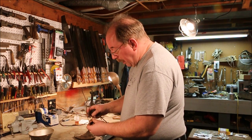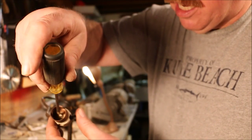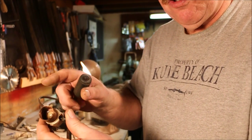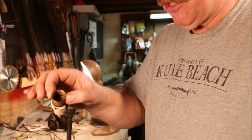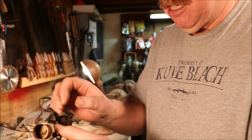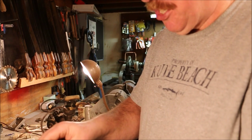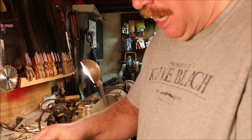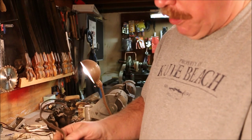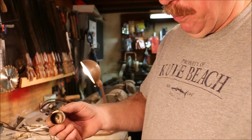Take the white wire — the one with the ridges on the outside — and hook it to the silver screw. Why the silver screw? The silver screw connects to that little screw down in there, which attaches to the outside ring, making that outside ring the neutral part of the conductor. If I were to touch this outside ring and be grounded, there shouldn't be any power in that wire so I won't get a shock. Now if there's a light bulb in there and the circuit's made, yeah, it'll be energized, but typically if it's just sitting with no bulb in it, I'm not going to get a shock. The reason I put the wire on that way is so that when I tighten the screw, the wire is drawn in underneath the screw and not pushed out — if I flip it the other way it tries to spread and come out. So now we have the polarity correct.